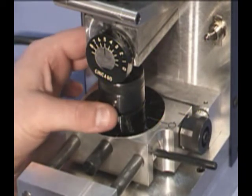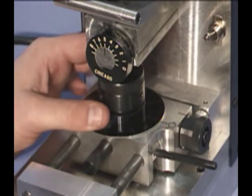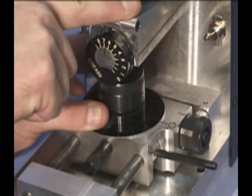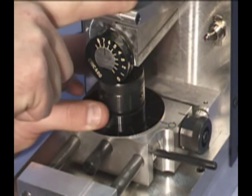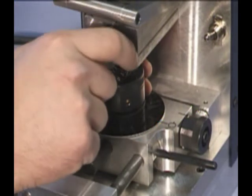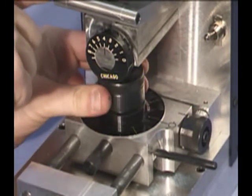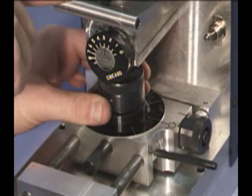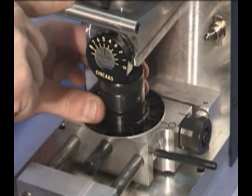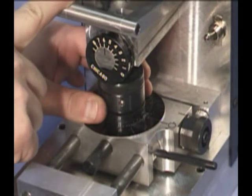Now rotate the chuck until the number 2 position is lined up with the space pointer. Set our cam for a number 7 cut. Depress the spindle lever and our second cut is made. We'll continue this procedure for the rest of the cuts. Line up our spacing plate, rotate the cam, and depress the spindle lever. We now have a perfectly cut key, right to the factory's specifications.